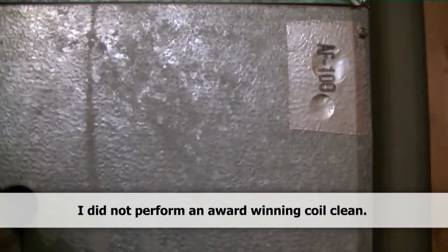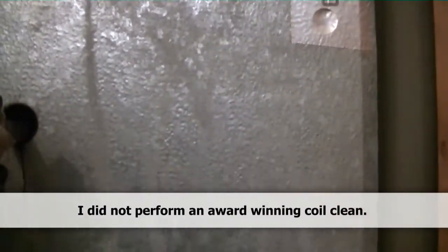I'm not convinced the drain was the issue here — it might have been the actual charge of the unit, because we put refrigerant in this unit about three years ago and haven't seen it since, besides changing the blower motor. I cleaned the coil a little bit in place and it is not in good shape at all — I sprayed it down with some foaming cleaner just to get whatever you can get at.